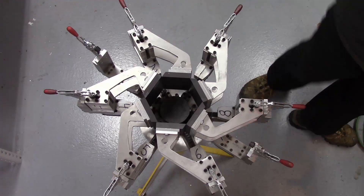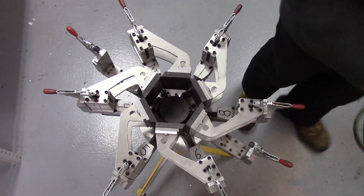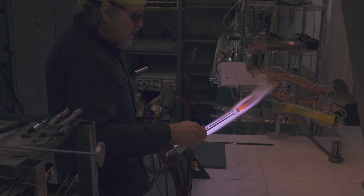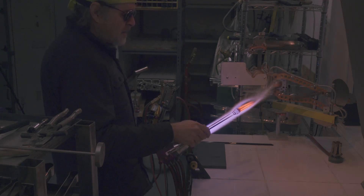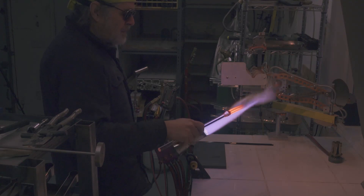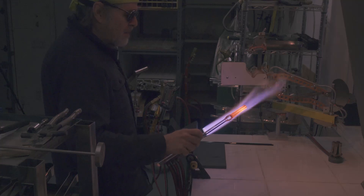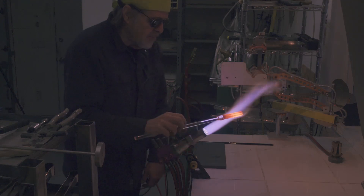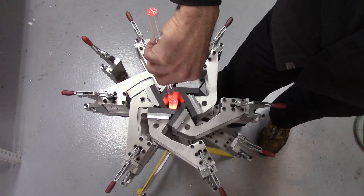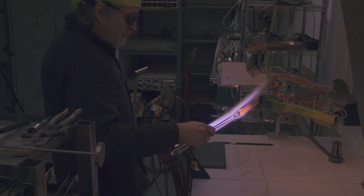Over to the squeezer to make the first squeeze — just to kind of stick everything together. Because as I'm heating the rod stack, if I get too aggressive before it's tacked, the rods are going to start bulging out — and yeah, ask me how I know that. So little by little, now that it's tacked, it's relatively stable, and I can concentrate on building the heat base and, more importantly, forcing out the air. I certainly don't want bubbles in my piece.